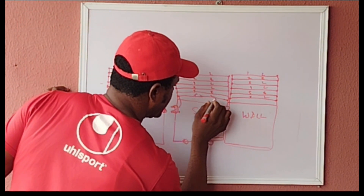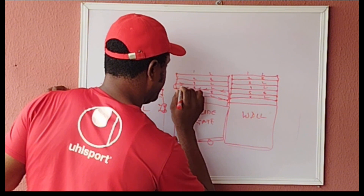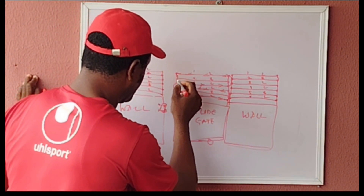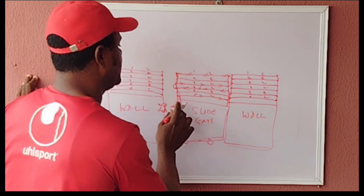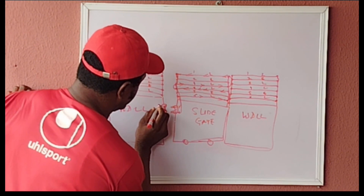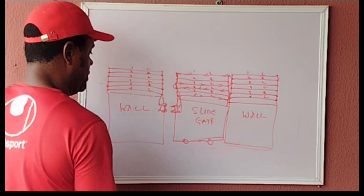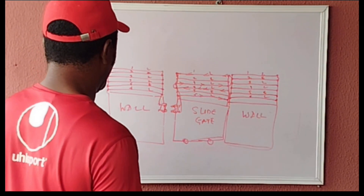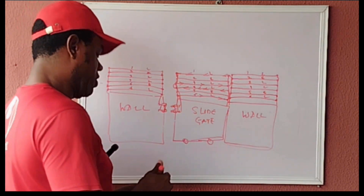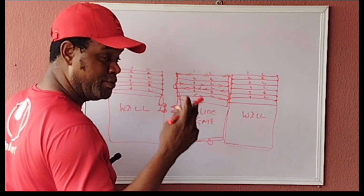So we will hit number six - live goes this way. The next section is number four live; we turn in to the live. This is the next live going to three, and the next live is one. Now from here use an HT cable to draw this - HT cable throughout this, through the posts - and let it come to this. So it means here it's sorted; it's just the male and female here. All I need to do is take one of these. These are static - they don't move. Let me take one to this place, then I need to feed this part of the wall, the fence.